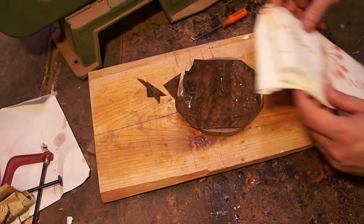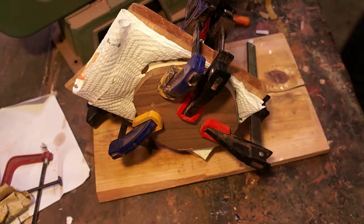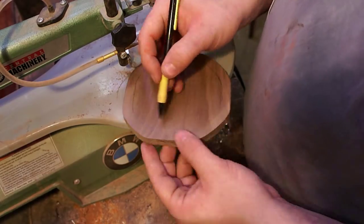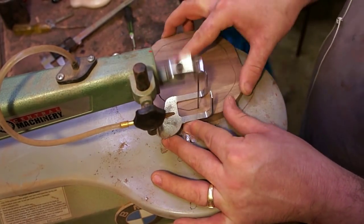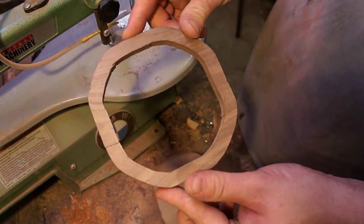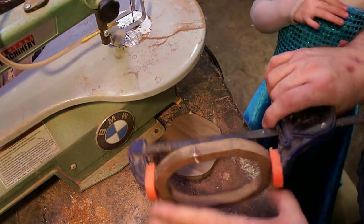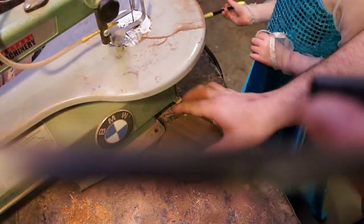To apply the veneer, I get all the glue on the back and then put something cushiony over it — sometimes I use a dish rag, sometimes paper towels like this. Put two boards on it, clamp them together, and let them dry. While that was drying I went back to the scroll saw to make the second layer of the top. I cut it out and then used calipers to scribe a consistent thickness all the way around the rim. I didn't drill a hole in the middle — I just cut straight through the edge, because it's easy enough with just one entry point and a thin kerf on the blade to go back in. Throw some glue on it, throw a clamp on it, and you'll never even see that transition after the glue is dried.